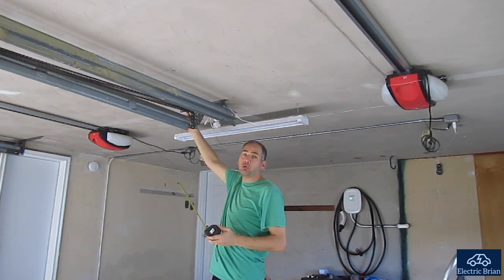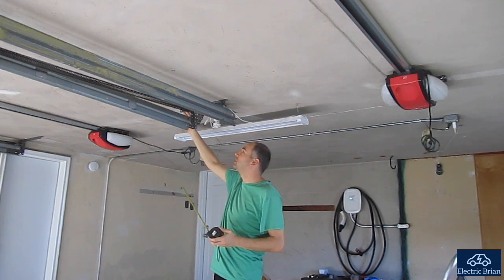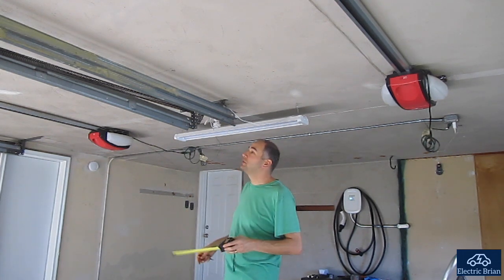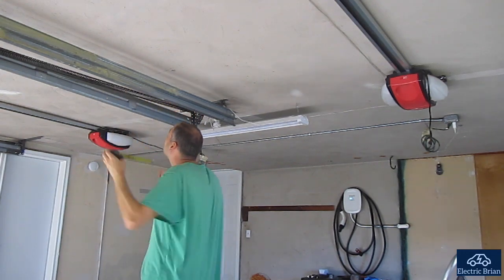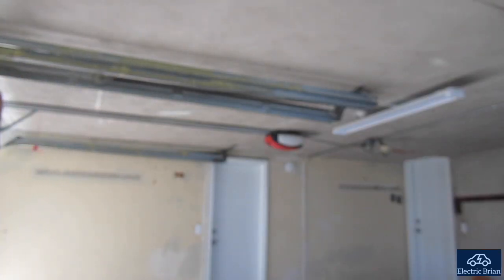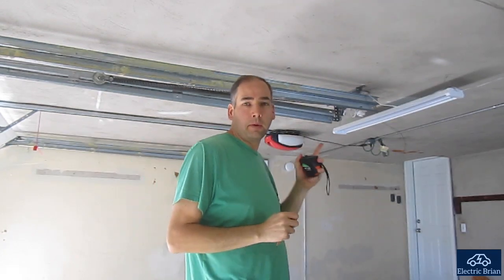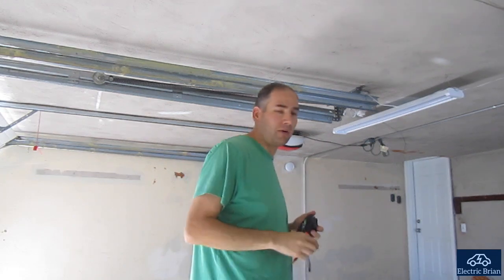You would think where the garage door opener is mounted that it would be a stud. The garage rails here don't line up with 16 inches. I might not be hitting any studs. We'll see. I'm not going to be using every stud, and there does seem to be metal behind the plaster, so if I miss the stud, at least it'll be in the metal.